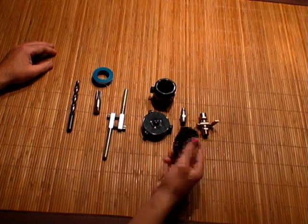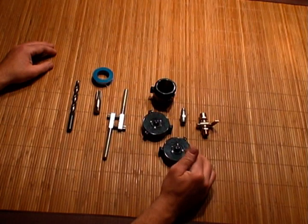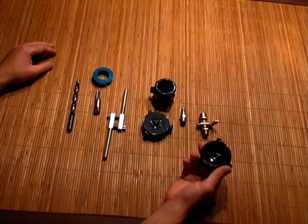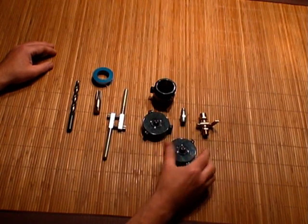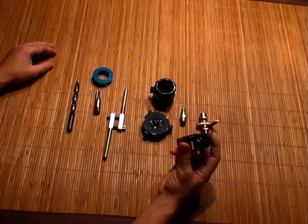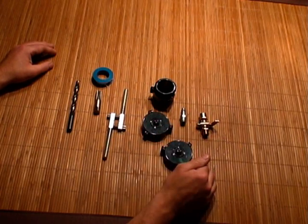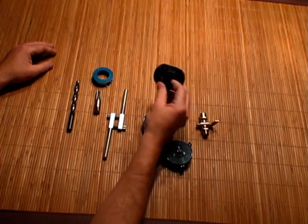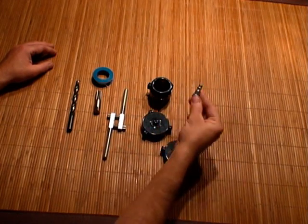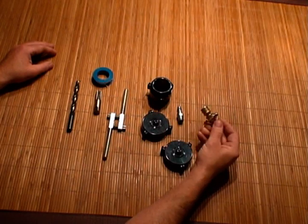You may also want a second coupling cap to seal off the end of your fire hose if your nozzle leaks — if you have a smooth bore or fog nozzle that doesn't have a good seal on the ball check valve, you could use another coupling cap. For costs: coupling caps from a fire service supplier are about $10 each, around $11–$12 for the double male, about $3 for the air chuck fitting from a hardware store, and the air shut-off fitting I got at NAPA for $17.